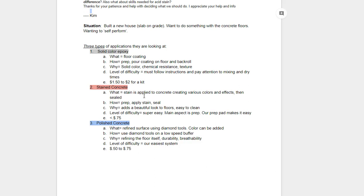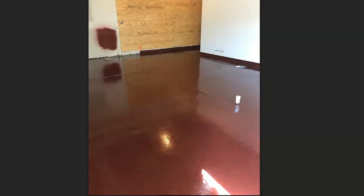Stained concrete is a very popular choice for in-home use — it has a really elegant look and creates various color effects, then you seal it. You prep the concrete, apply a stain, and put a clear coat over it. We have system kits and instructions for each one so you can follow along. Why would you do stained concrete? It has a beautiful look, it's very easy to clean, and it's a very popular floor — a lot of retail places have done stained concrete. It's a very easy system to do and your cost is going to be about half of epoxy — under a dollar a square foot.